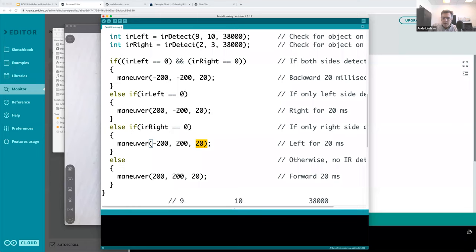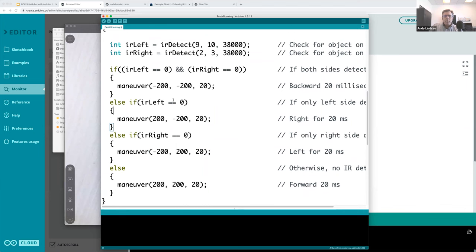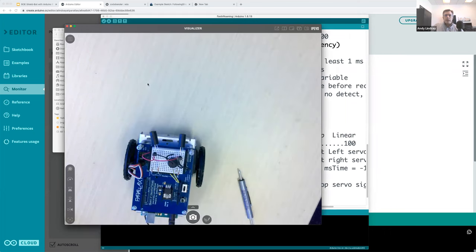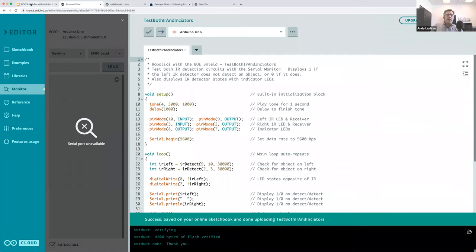Can it be an audio tone? No, well, I mean, you could use an audio tone, like we do with the speaker, but the filter inside the infrared receiver is what is looking for 38,000 blinks a second. All right, how's that? Kind of a little advanced explanation.